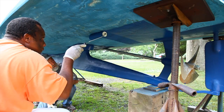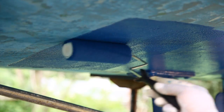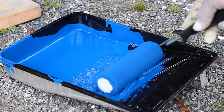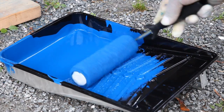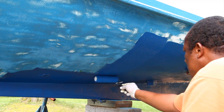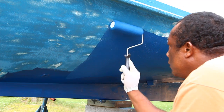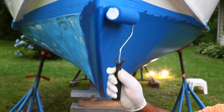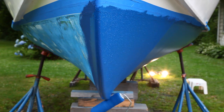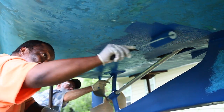Kenneth is starting to roll out the bottom with the roller pan right in front of him so he doesn't have to spin around. He's going to pick up a little paint on the roller by dipping it in the bottom of the pan, then roll it out at the top of the pan. You don't want too much on there because it'll come off the ends of the roller and make a mess. He'll distribute it around a little bit - it'll look a little bubbly, but going back over with a slightly drier roller will flatten those bubbles out.